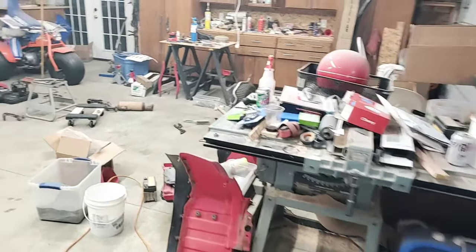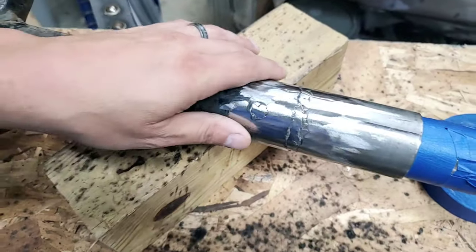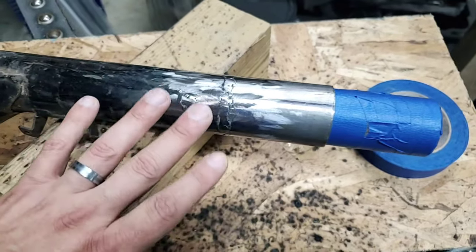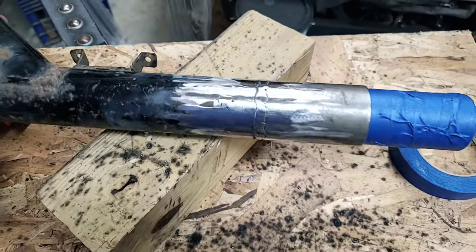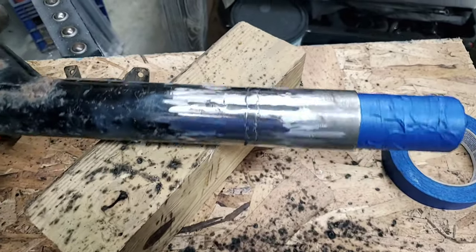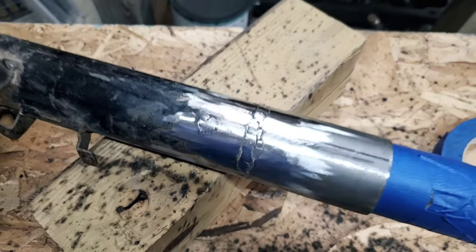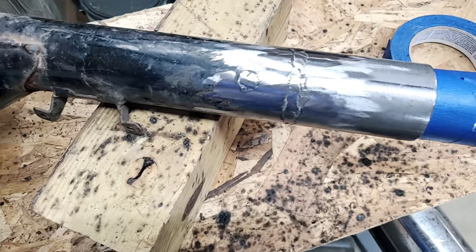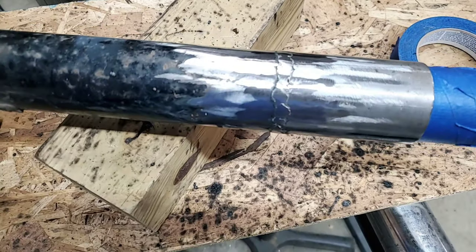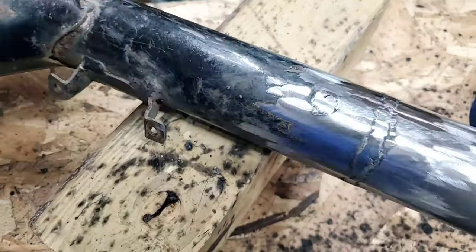Now a disclaimer: not everybody is good at welding. I am in that group. And if you'll notice, there's a lot of grinding and a lot of spatter marks. I was having to figure out why I was getting so much spatter. Here's where I drilled the hole on the one side. It kept telling me to slow my feed speed down on MIG welding, and I had it slowed down so much that I could watch it pulse in there and it would spatter. So I raised it and that worked better for me.